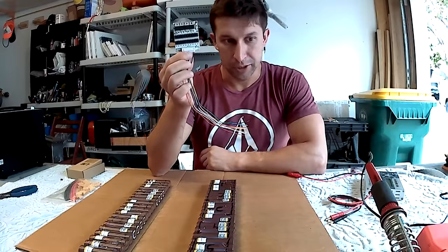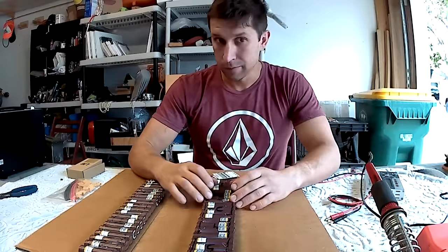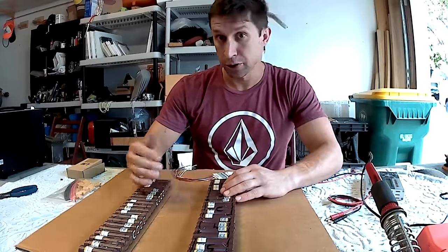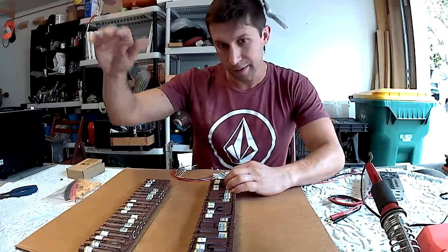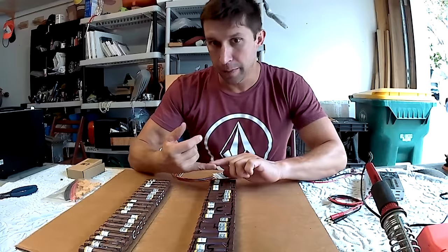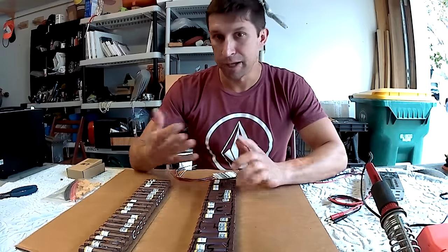If you do not use a BMS and just straight charge the battery over a few cycles, the cells that have somewhat bigger capacity will charge slower. The cells with a lower capacity will charge fast. Therefore, low capacity cells will become overvolted, and the large capacity cells undervolted. Overall capacity of the battery will go down, and potentially it will damage your battery.